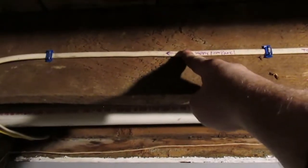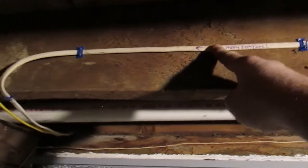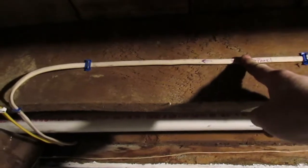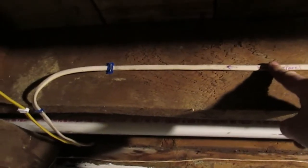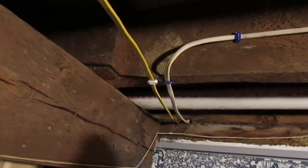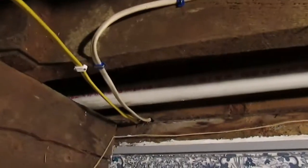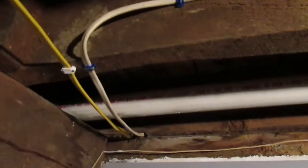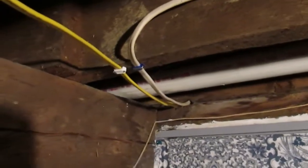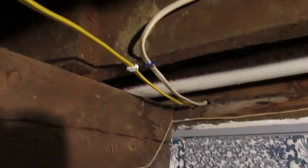This is the supply wire coming in from the panel. This is actually a 12-2 wire also. This was brand new. I took it right off of the roll. This would predate 2001, I believe. That goes up into the outlet. I pigtailed them together up in there, and then I brought this yellow one back down, and this goes over to a counter outlet in my kitchen.